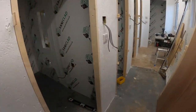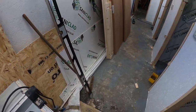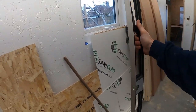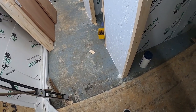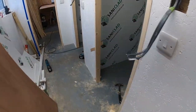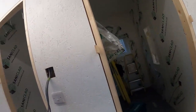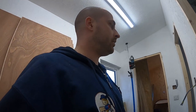I use board-fixing foam to fill the gaps — it helps with sound insulation and also steadies the frame as well as the fixings. It's a win-win and won't take a lot — probably one can for the doors depending on the gaps. As you can see I've made some progress. I've been using the level for the hinge side first, planting it in, getting the laser level set up for head heights to get them all in line — especially when you've got so many doors in a row. I'd also suggest getting a two-meter or 195 cm level, because with a 1.8 m level you sometimes miss a belly since it doesn't go all the way up. Doors are nearly two meters and a level 200 mil shorter means you could miss a bow in the lining. Anyway, I hope you enjoy this video and I'll catch you in the next one.